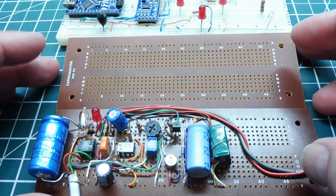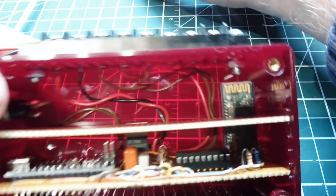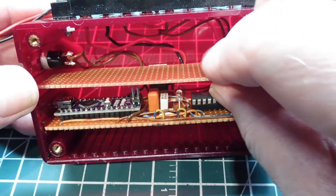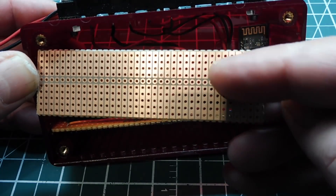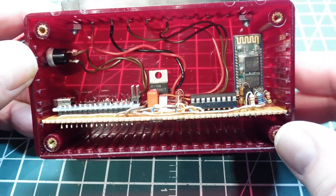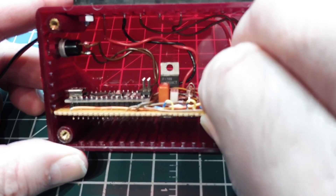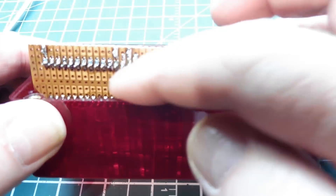Now you have to put it into an enclosure. One option is a plastic enclosure like this one here. I mounted my Arduino project into this plastic module and you can see there's a Vero board in here. It has an isolation channel down the center and you can mount that right inside the enclosure. I have an HC-06 Bluetooth module in here, which is why I use a plastic enclosure, but you can get metal enclosures too. Everything is soldered on the bottom, and there's your isolation channel.